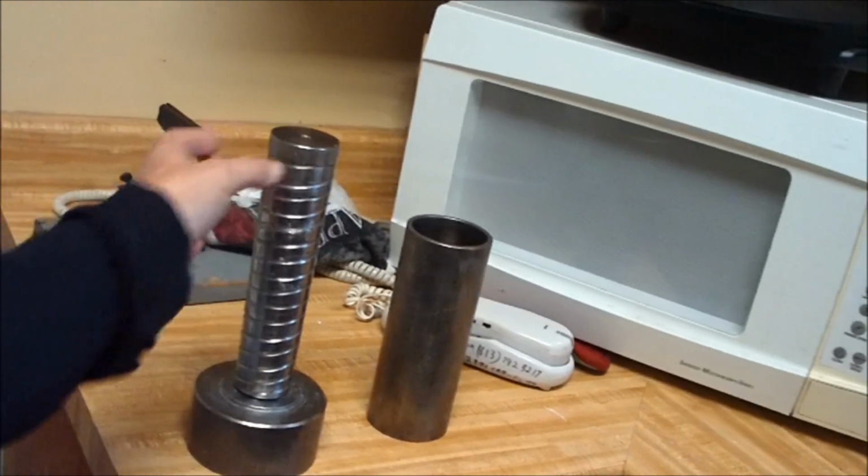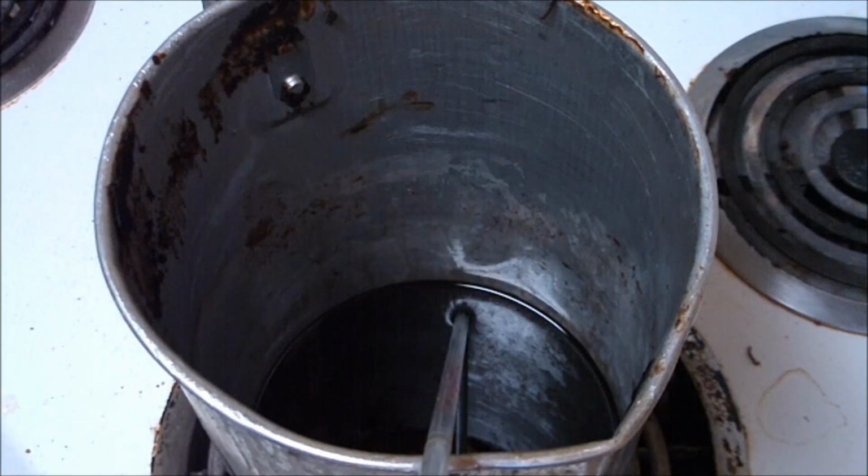So we have here a mold in the oven that we heat at 300 degrees for 1 hour. This is important as it lets the wax slowly cool. Never force cool cylinder record compound. The more you force it, the worse bubbles, stars, streaks, dendrites, and other defects could be. So slow cooling is the key to making great blanks.